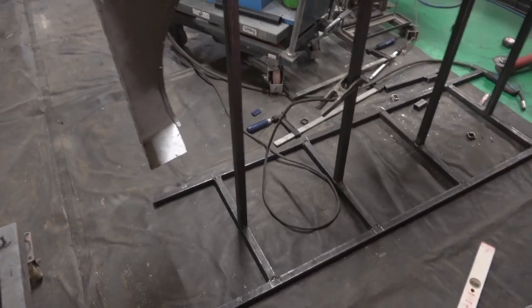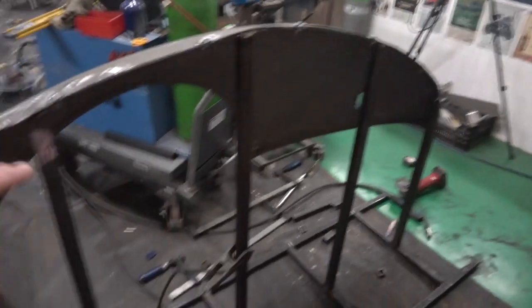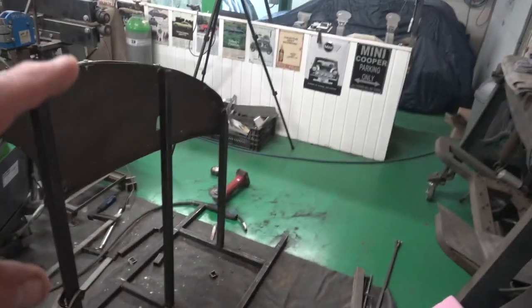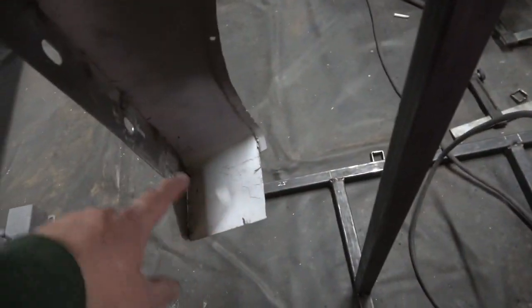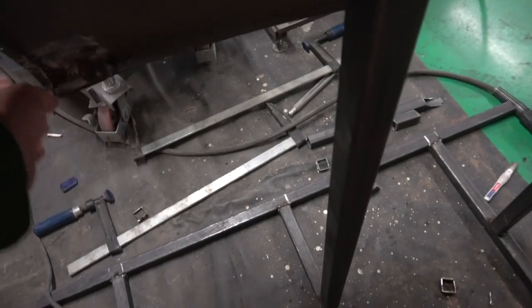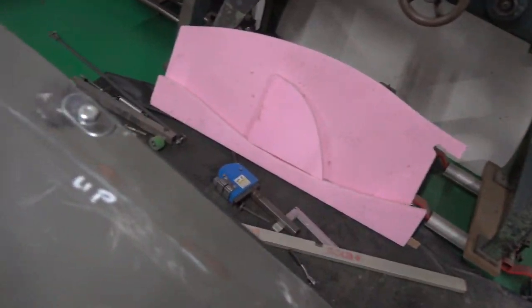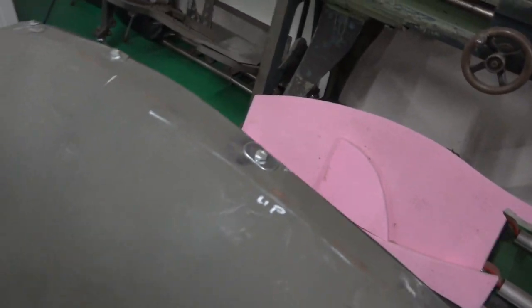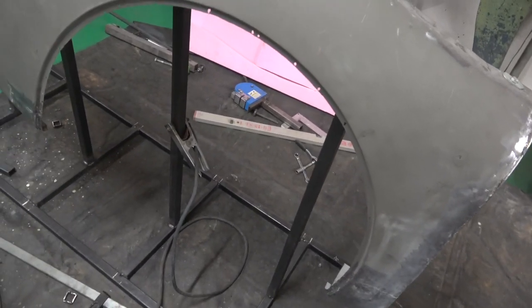This is where I've got to so far. So I've got the uprights in it now. Pretty steady. I've got to just finish up some welding on the front and back one. These two main ones are done. Finish that one up, weld the one on the back. And then what I'll do then is make a bracket to come from here across onto here to stop this, so this will be solid, and then the same here on this hook on the back here, so it's nice and solid. When you're actually working on that with your foot, you can see it. I can always put a few more stays in it if I need to. It should be finished in another hour or so. That'll do the job.